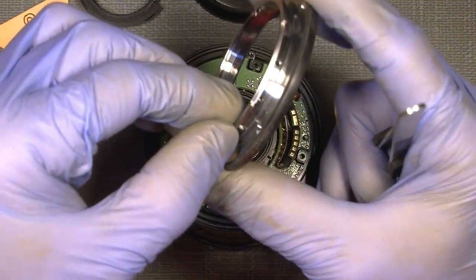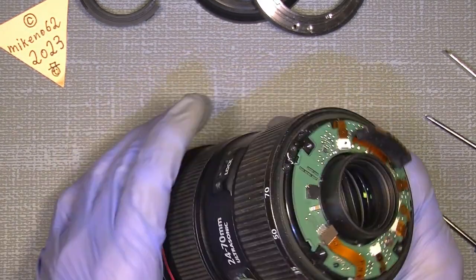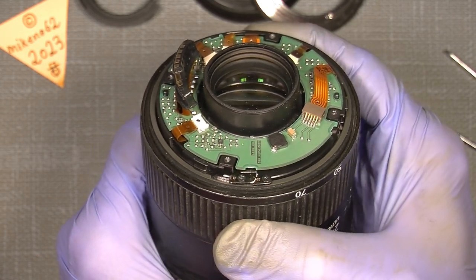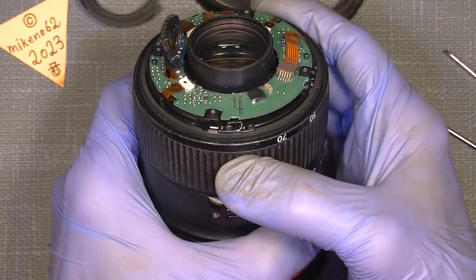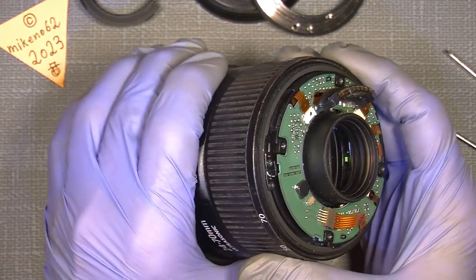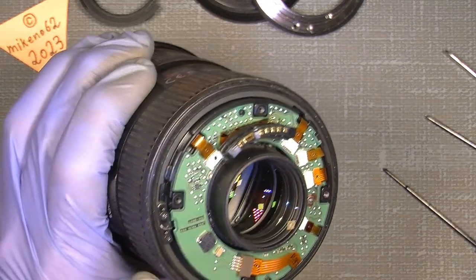The contact bridge can only sit in one way with the two screws. So now we're looking into the circuit board, and that's what I found out. What is the problem? You maybe can see it already — not the circuit board — but the problem is actually the key. If we move it here you can see it's actually broken in two parts. If it's steel I can probably weld it together with a piece of silver and a flame. You can see it's really a problem because it's wiggling — the screw is loose and the pin that way also gets broken.